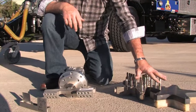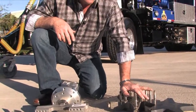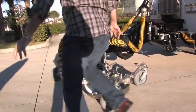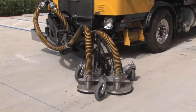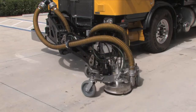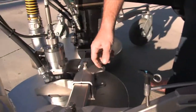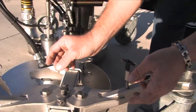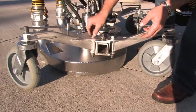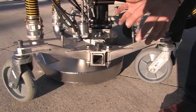If I were to try to lift the apparatus that spins this particular bar, I would surely not be able to do that — it's a very heavy and large piece of equipment. Let's take a look at the dual head that is a component on the Stripe Hog 8000. This machine produces 12 gallons per minute; each of these heads handles six gallons per minute and handles bars from 22 inches to 36 inches. To position these heads along the bar, you simply loosen this piece and it slides freely in and out. The wheels can be positioned in a wide variety of configurations by simply loosening these bolts, and they'll swing around. If you loosen these two bolts, the whole thing can slide freely up and down this bar.